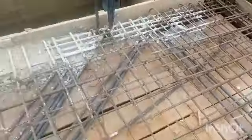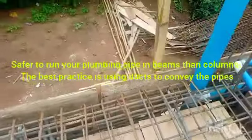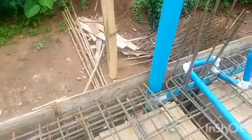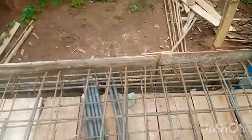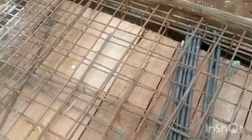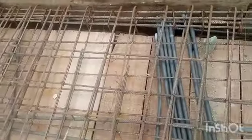You can leave a comment and ask questions for clarity and we'll explain. One more thing: be very careful not to run your mechanical fittings on columns — make sure they are away from the column. On the beam they can be okay, but on the columns, no. Also remember to give your reinforcement a minimum cover of 15mm.